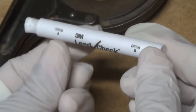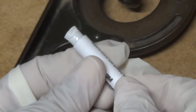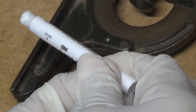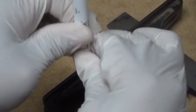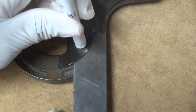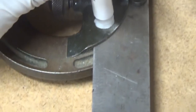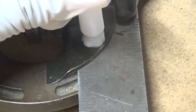From experience, you have to crush it — it takes quite a bit of force to really crush this cardboard. I'll do one at a time. There's one — there's a slight pop you hear — there's the other. Now we shake it, then squeeze again. Now we know our swab is activated. I'm going to come in contact here with the metal and the paint, giving it a little bit of force but not pressing down too much, squeezing at the same time I rub back and forth. I need to do this for about 30 seconds — they say it may take as much as 60 seconds.